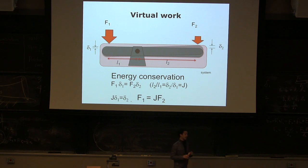But if you think about it, even the free body diagram is based on geometry. Why do we get this ratio? Because we did the force moment balance, and the moment balance has to be done through the geometry. This guy has a longer moment arm, so I don't need to apply the same amount of force to match this balance. So we're talking about the same thing projected into different perspectives and solved differently.